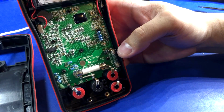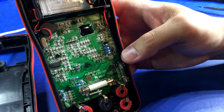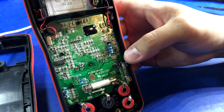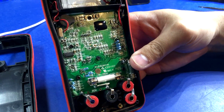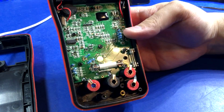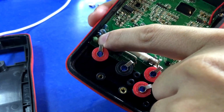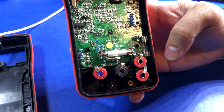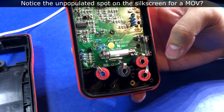Chip on board. A lot of through-hole resistors, but everything else is SMD. A ton of analog SMD stuff going on. Couple trimmers, got a crystal over in that corner, speaker. Surprisingly, the 3 screws it takes to open this up were all machine screws into metal nuts, so that's pretty good. These are the cheaper type of input jacks, but they're fine. And then the weakest possible little PTC in the corner, that might be the smallest one I've ever seen. That's not SMD. And I think that might be the only input protection that I can see right off the top.